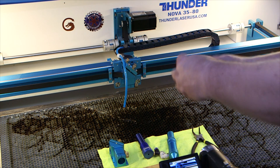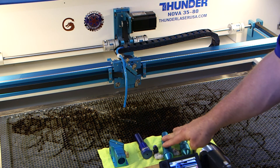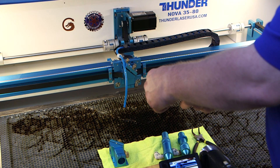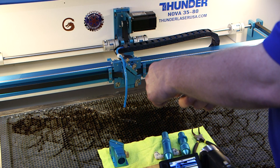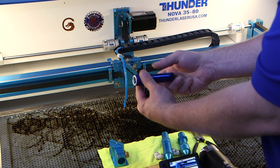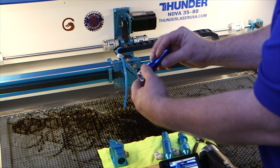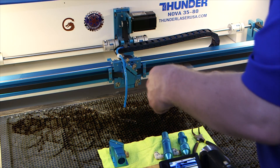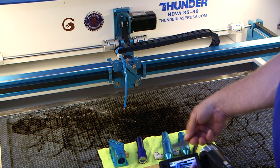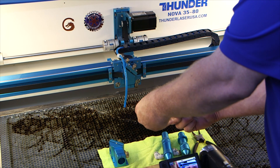I'm going to have a specific video just for lens cleaning. The beam buddy has two optics in it — it's a multi-element lens. You'll have one in the top and one in the bottom. The nozzle comes off, the lens tube comes off, and then you can access the spanner rings on each side. There's a special spanner tool for those — it comes in your tool kit, so don't throw it away. You'll need it for the spanner rings, and also for your mirrors.